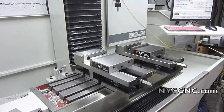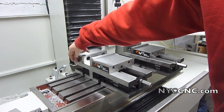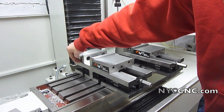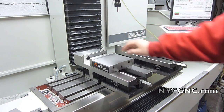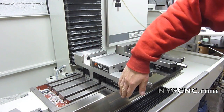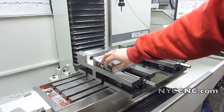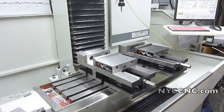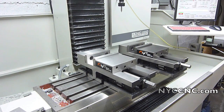Let me get this cleaned up. Here they are — they're not bolted down, I just put them on the table so you can get an idea of size. The first feature to point out is that these have a solid rear jaw. On most vises this piece is separate with a piece of key stock holding it together, so this will have less flex. There are standard replaceable jaws, and one of the things I plan on doing is using soft jaws for a lot of projects. The most distinguished feature is that the three sides are ground flat — very flat — which allows you to do some pretty cool things whether it has to do with setup, using dowel pins, putting the two vices close to each other, or turning them up on their side.